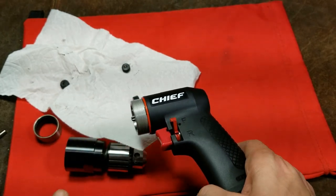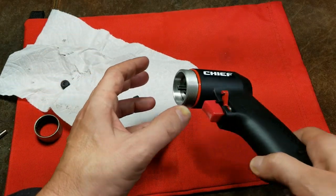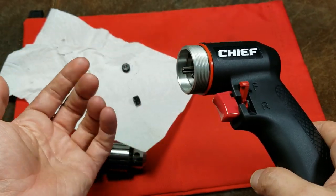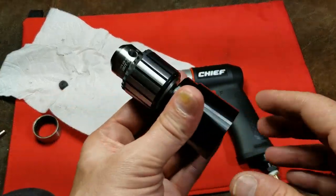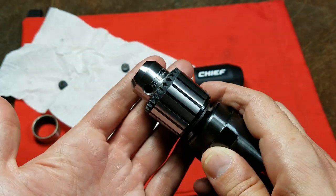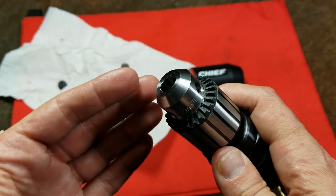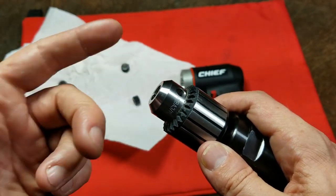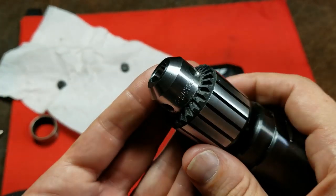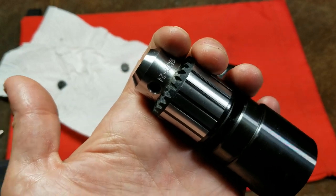I have this apart, and there are a few comments about pulling it apart. Unlike that old air drill, most air tools can be disassembled down to the air motor. On drills it tends to be more complicated, because they always have set screws down in the middle of the chuck — in this case a 3mm hex. They put a bunch of Loctite on it, and I ended up breaking a little 3mm impact bit as well as twisting a hex key. That screw is in there really tight, and it's going to have to be drilled if you ever want to remove the chuck, unless it works itself a little loose through use.